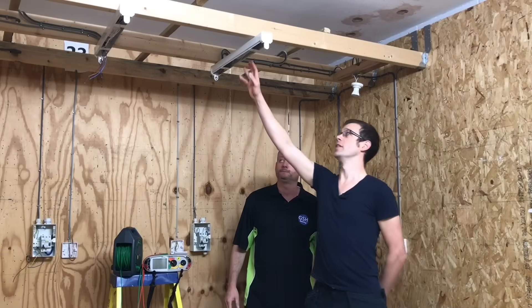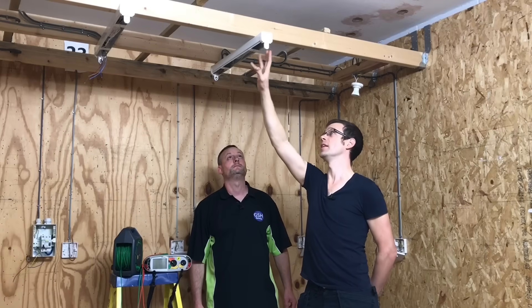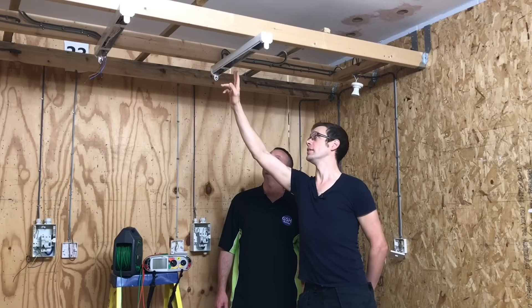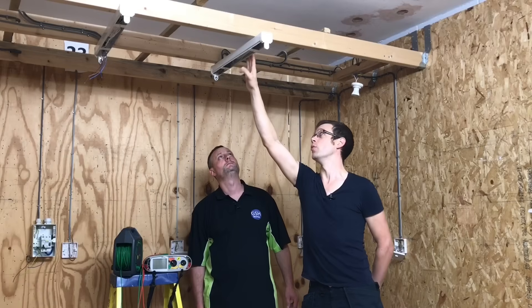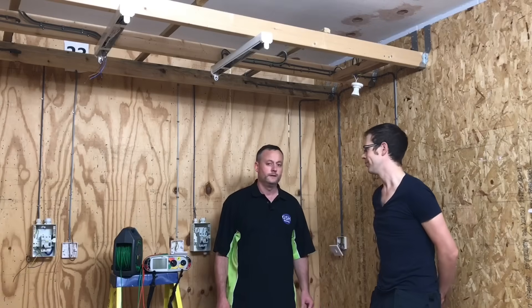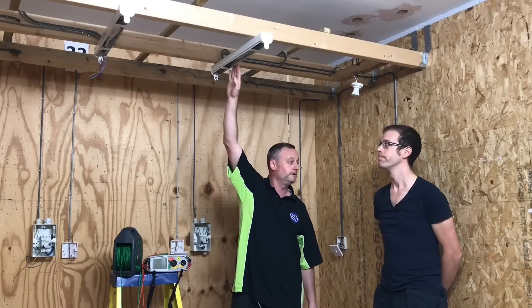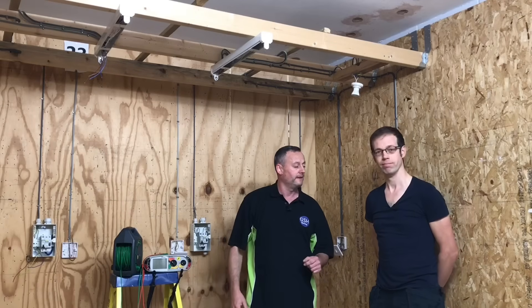This fluorescent has a metal body, and because it's made out of metal it's not double insulated, so that metal body is an exposed conductive part. What we're going to do is prove that the CPC is continuous not just to the terminal inside there, but also to the actual metalwork — that way we can be sure that this is connected to earth. There's no point proving the CPC only gets to the connector block within the fitting itself without making sure it gets to the exposed conductive part as well. So we're going to remove the resistance of the lead and carry out that test.